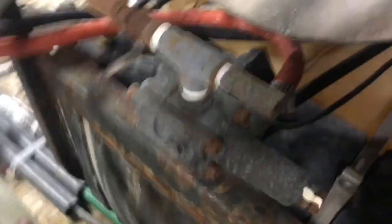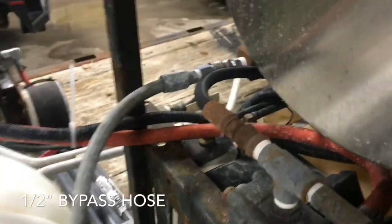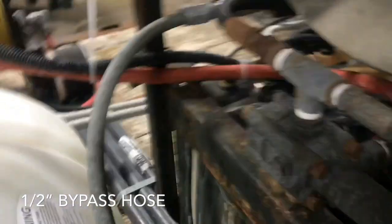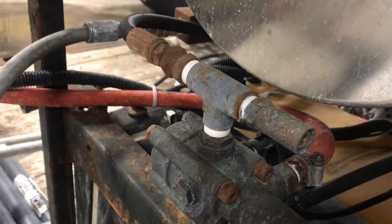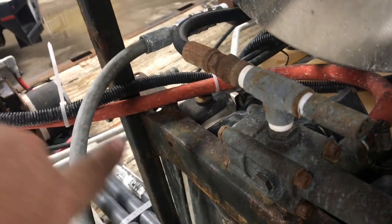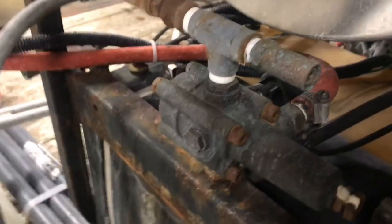This being hot water, it actually comes out over there out of the hot water side. This is my high pressure line. On the back side of the unloader we have a low pressure bypass hose that runs in and dumps into the tank — that's the bypass hose. We use this hose so our unit does not get too hot. Some bypass hoses will go right out, but you want to run it into a tank. If you leave the bypass hose and don't run it into a tank it will overheat.